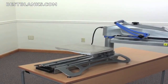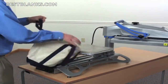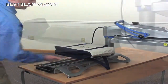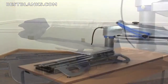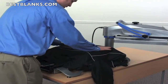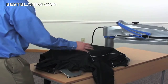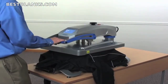Let's show you a bag. This openness underneath the bottom platen means I can actually split open a bag, thread it on, and let the excess bulk hang below the platen. For a jacket, operating it as a swing away, I load it to reach the back area of the jacket so all the bulk hangs underneath. I don't have to worry about the zippers that I'd need to worry about if I laid it flat on a 16x20 platen.